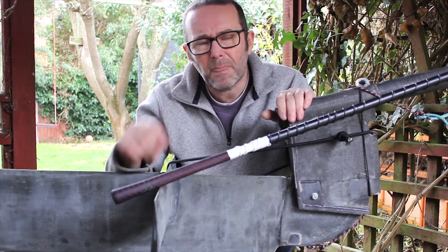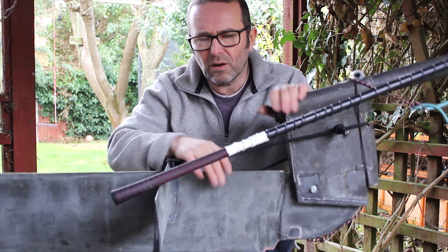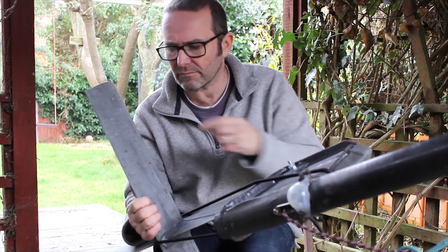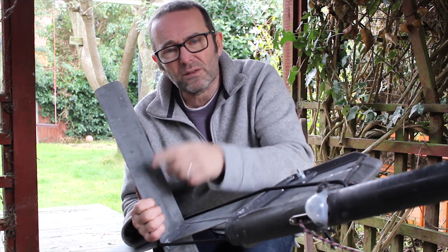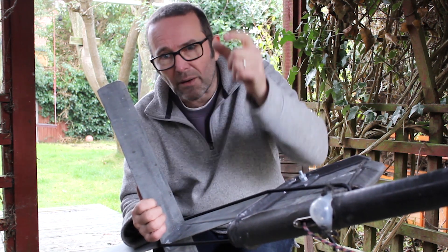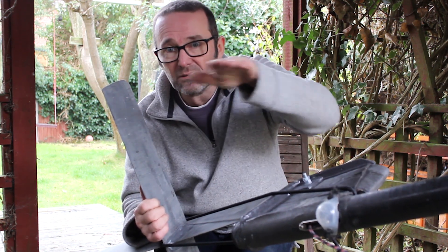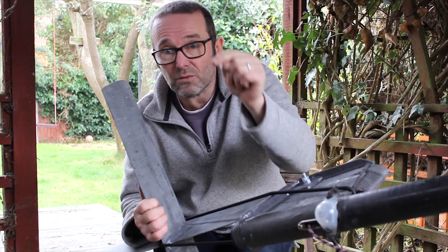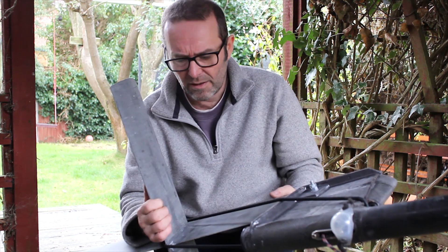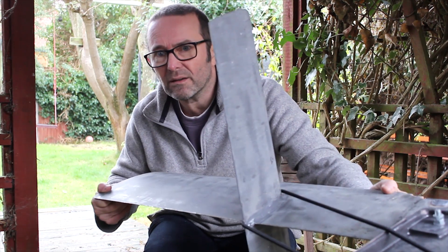I then had a profile marked — did this very old-fashioned way. Made a profile with lots of lines, scored a lot of lines of a known depth to get that curve, and then carefully set up a router. I'd route down one line at a certain depth, then move across to the next line, adjust the depth, route down that line — so I ended up with a profile that was effectively lots of little steps, but set. Then I sanded it flat, turned it over, did the other side. Because I'm doing this old-school, this is just a square, even section wing all the way across.